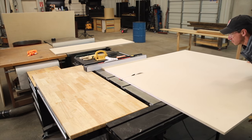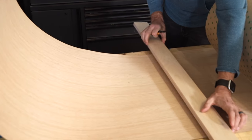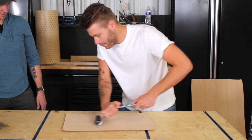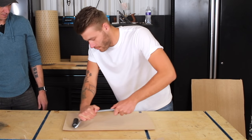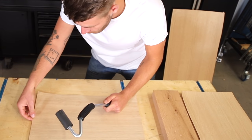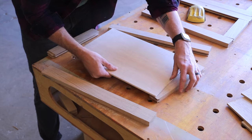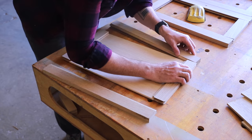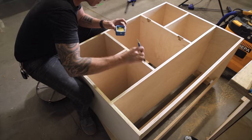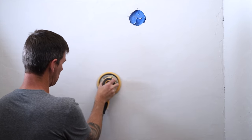I also designed and built my own bathroom vanity to replace the old one. Initially I wanted to skin the existing vanity in white oak pressure-sensitive veneer from Rockler, but I ended up deciding to build a vanity out of Baltic birch plywood and then skin all the show faces and door panels out of that oak veneer. That was a pretty involved build and it needs its own video, including using PSA veneers, making doors with rails and stiles, and building a face frame cabinet.